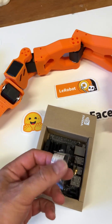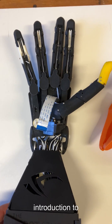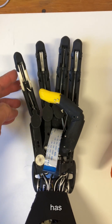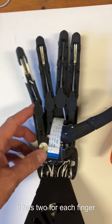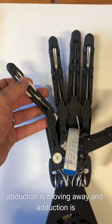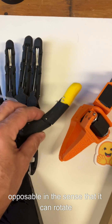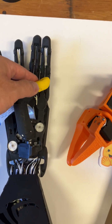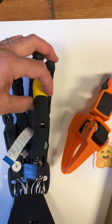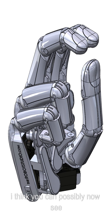As part of the system on the Robot Nano Hand, there is a camera which fits up in the middle of the palm. The purpose of that is to act as an introduction to the world of computer vision with robotics. This hand has 10 degrees of freedom — two for each finger, one which closes the finger and one which gives abduction and adduction. Abduction is moving away and adduction is moving towards. Each finger can close independently, and the thumb is opposable in the sense that it can rotate and reach down, though it's opposable to the first and second finger only. It comes together in a pinch grip and various other patterns.